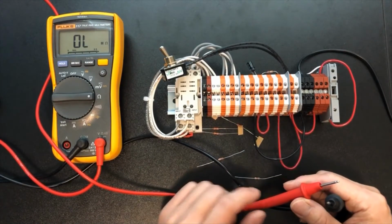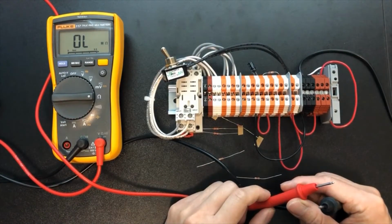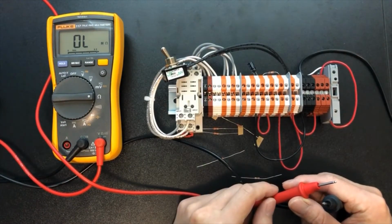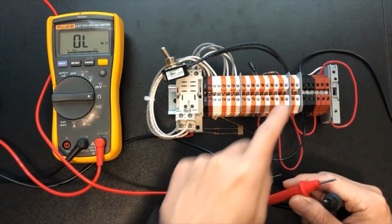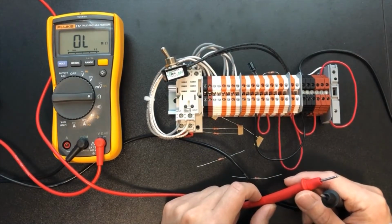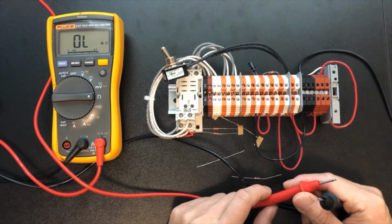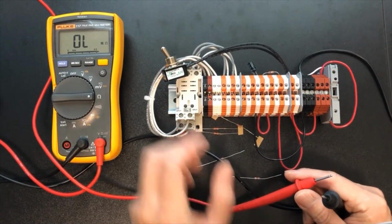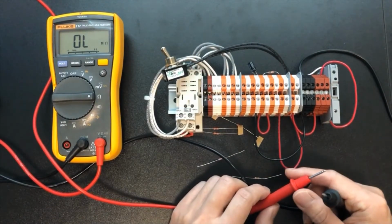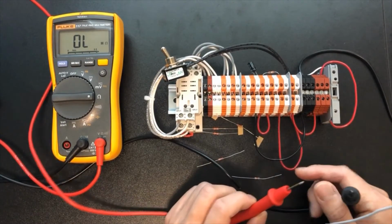All right, so now you need to determine the on-off state of the switch. The switch on-off state is not labeled. What you can do is take off the switch and measure the resistance. Right, if in off state, your DMM will show OL. That means infinity. Right, if it turns out to be on, then your measurement should be close to 0. Okay, that's what you can do there.